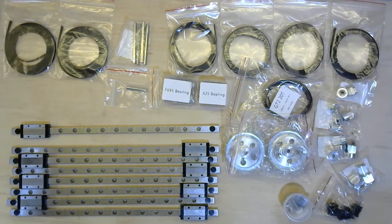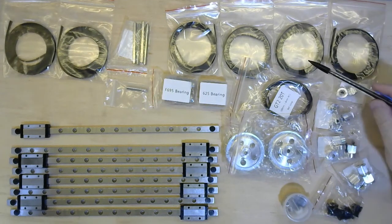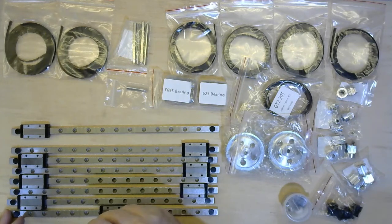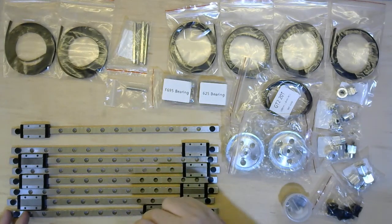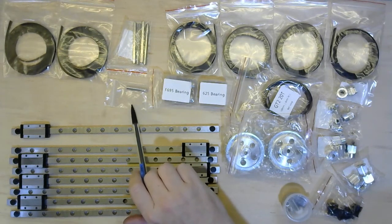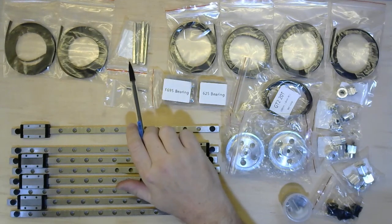Section 2: Motion. All exact counts here. Belts are pre-cut and lengths are as given in the BOM. Belts say Gates. Bearings say nothing. Linear rails are unbranded. They also came with a light shipping oil, so these were degreased, rinsed in isopropyl alcohol to remove the degreaser, and then repacked with NLGI 2 grease. I used 3 grams and have 497 grams left over — maybe the lawnmower would like some. The one shaft for the D end stop is not ground. The four shafts for the Z drives are D-shaped for their entire length.